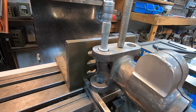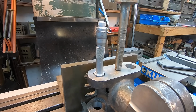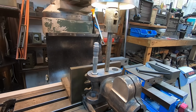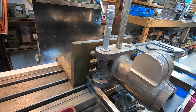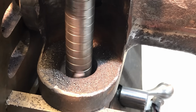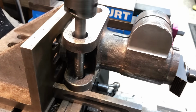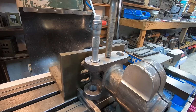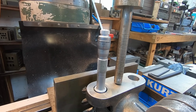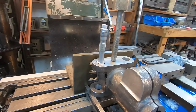I'm making nice progress on the left side holes here. Just taking a measurement with the bore mic there. It's saying that I've got 14 thousandths to come out of both holes there. So getting ready to make one more pass with the bar, and hopefully these guys will be finished up. All right, the boring is finished up, and this side right here I was able to hit my mark of 1.125. We are right on it, so a little bit better results for that side there.